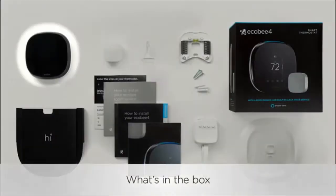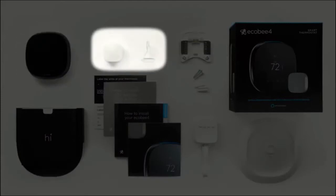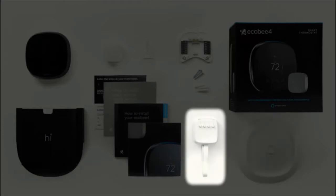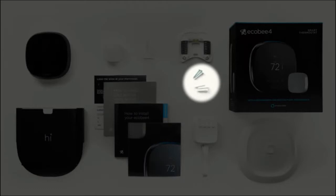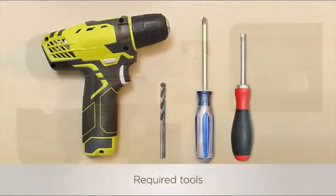Here's what's in the box. Your Ecobee 4 thermostat, the backplate, room sensor and stand, a large trim plate that's optional so you don't have to install it for your Ecobee 4 to work. Power extender kit, you might not need this either. Mounting screws and plugs, your Ecobee 4 install manual, your room sensor install manual, wire label stickers, and your Amazon Alexa voice card. Make sure you also have the following tools handy: a Phillips screwdriver, a small flathead screwdriver, a drill, and a 3/16" drill bit.